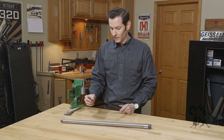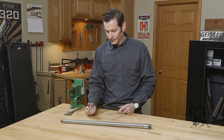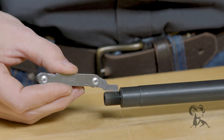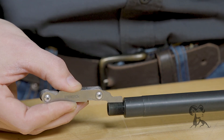For this one, I went ahead and got my 28 pulled out. I know it's a half by 28. You're just going to lay these teeth on the tool into the threads on the barrel, and they should all fit perfectly and close the gap — and it does. That's how I know this one is indeed half by 28.